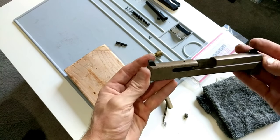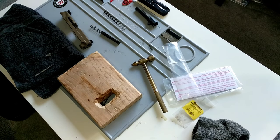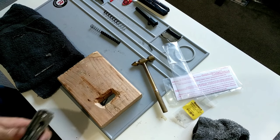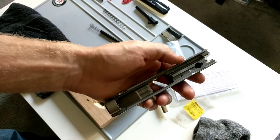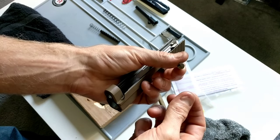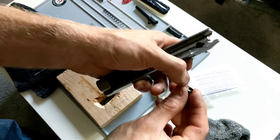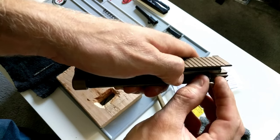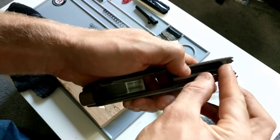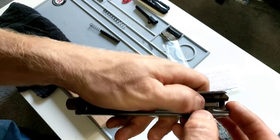She's pretty dirty — this is probably about two thousand rounds since I took this apart. Everything is cleaned off now and we'll start putting everything back together. The first thing will be putting this little safety piece back in. Make sure you remember the way it was when it came out — the half-circle will be towards the back with the cutout facing forward.